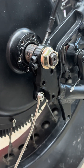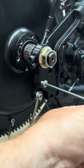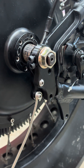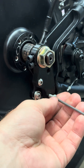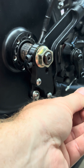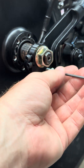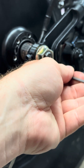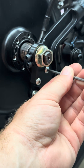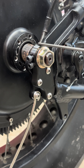Then you add a couple of M5 bolts through this and into here, and this will clamp the whole thing together while still leaving room for the fender mounting point. It's really hard to model these things because there are no drawings online, so I didn't extend it all the way up into there — I would have also had to drill out and add mounting holes up there to make that worth the effort. With that I'll have a really nice torque arm: it's very long, it's going to have a lot of meat on it, and it's going to clamp this motor in place very effectively.